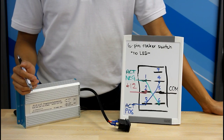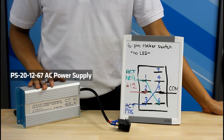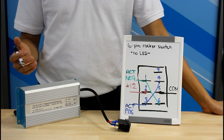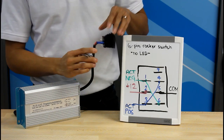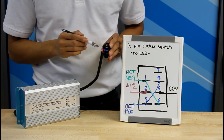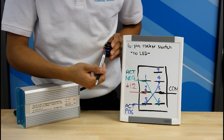Let's start off with the power supply. Here I'm using a PS20-12-67 to allow me to plug into an AC outlet. If your application is in a car or a boat, you could use a 12-volt battery as well. The red wire is typically positive, but you should always make sure with a multimeter. Here I have the positive going to pin 2 and common going to pin 5.